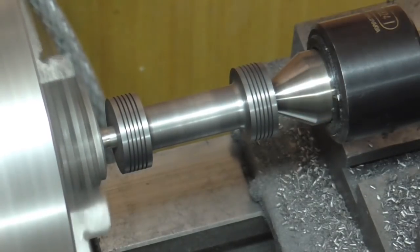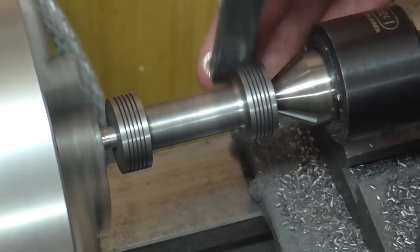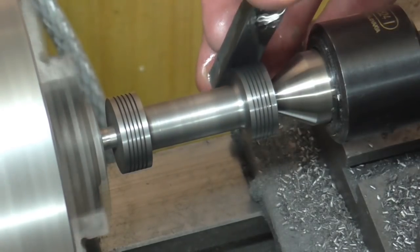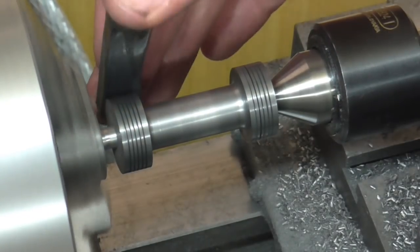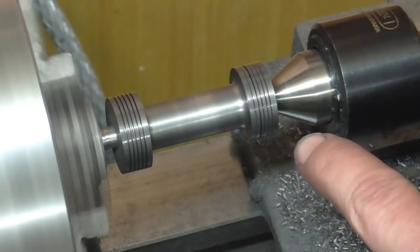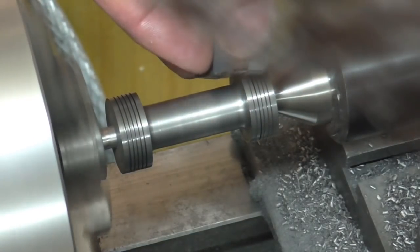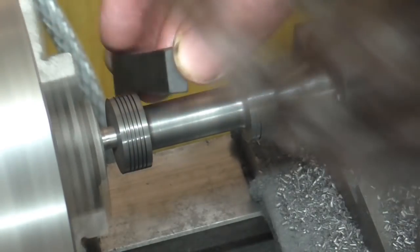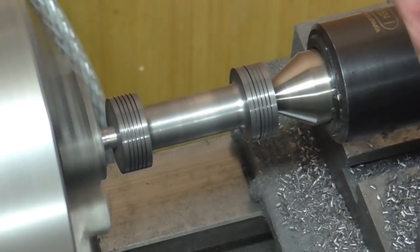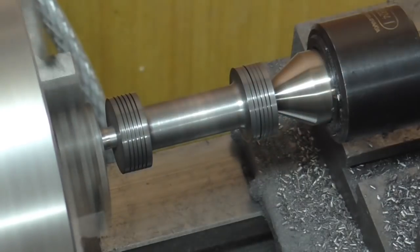In case you were panicking earlier — yes, this stone is very uneven down the sides, but the actual main faces are really nice and flat. Just deburring anything that may have been brought up from those grooves. I don't really want big chamfers on these corners either — I'm just going to break the edges with a stone, and again try to keep the stone moving at all times. I'm resisting the temptation to put the stone down that groove — I can guarantee even if there's a bit of clearance it will bite and not end well.